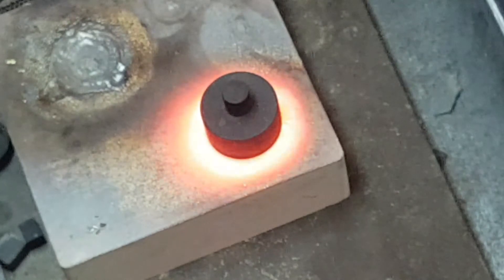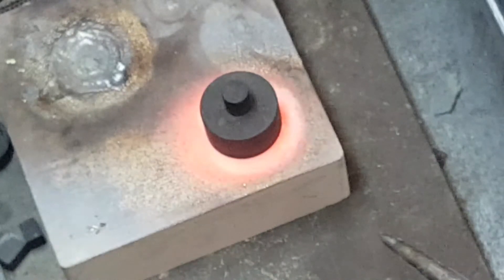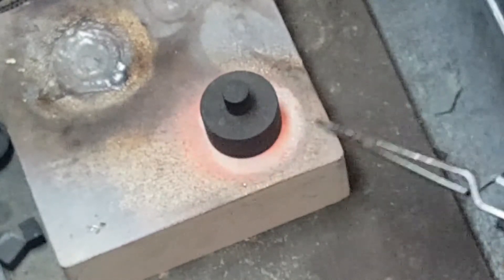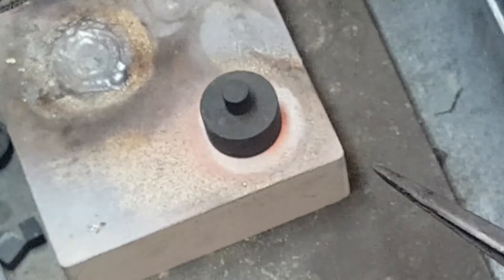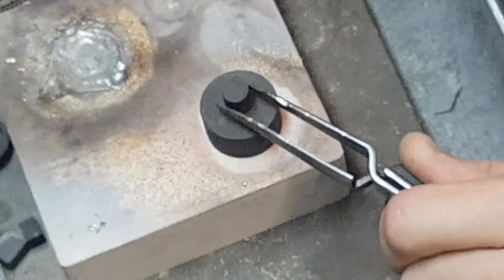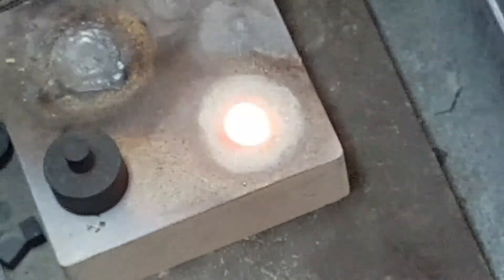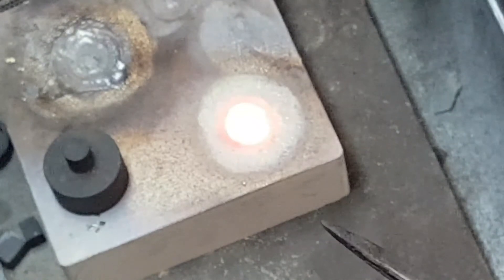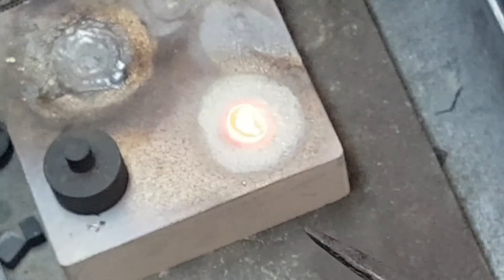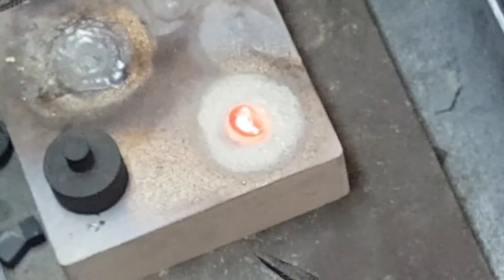I'll just cap that and wait for it to cool down a little bit. You can see all around here it's still very red hot — that's super hot metal. As it cools, you remove the cap once it gets hard. All I want to do is stop any oxygen going into the metal and giving it bubbles — that's really not what we want. Also, never use steel tweezers on platinum. Some people do and say they don't have problems, but it can contaminate it and make your final polish hard — you just never get a perfect finish.